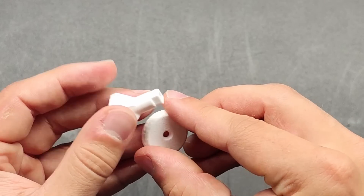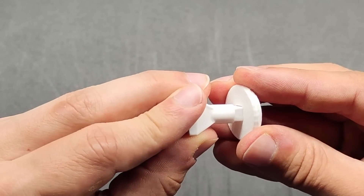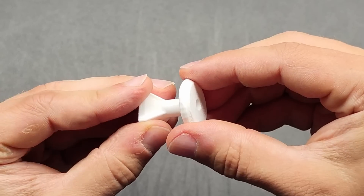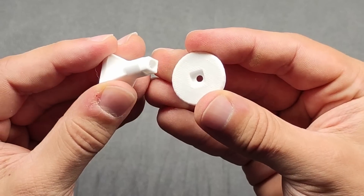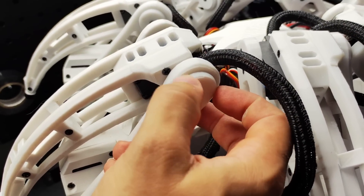I extended a square peg from the round shaft and made a hole in the friction pad that the square peg could slide into. This design is better than the original in literally every way — it's more robust, quicker to disassemble, and easier to print.